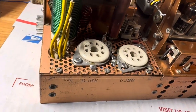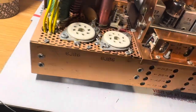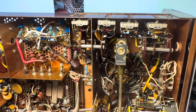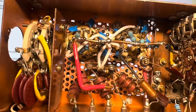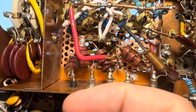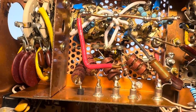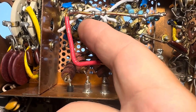I'm trying to close in on finishing this thing up. I have all the capacitors installed and all the cathode return resistors installed. As the guide said, I put in 10 ohm resistors — three of them per tube — and put a little bus bar in here as a cathode return bus bar. I did that, hoping this isn't too much resonance. The band switch wafer still has to go through here, so I think it'll still fit.